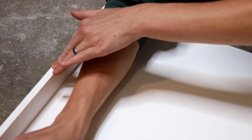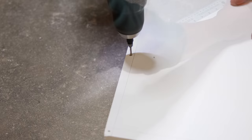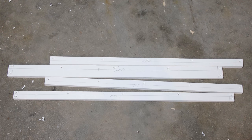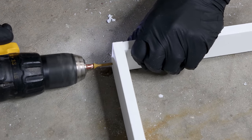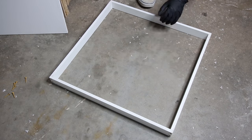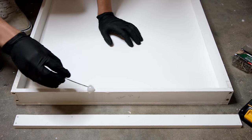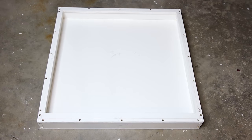Let's put the pieces together. I used one of the strips to mark for the width of the middle pieces on the back. I also marked for where the screws will go. I used a countersink bit to pre-drill holes for the screws. Screws will go into the boards without cracking them, but the holes will make the process easier. After pre-drilling the holes, I went on to attach the pieces together, starting with the middle section. I applied cement where the boards connect and screwed them together accordingly. Once the middle frame was built, I applied cement to the entire edge of the piece, did the same for where the back rests on this edge, pressed the pieces together, and secured them with screws. I went on to repeat the process a third and final time for the strips that go on the front, then let it sit overnight while the cement cured.